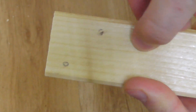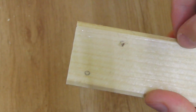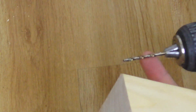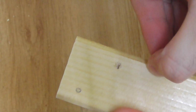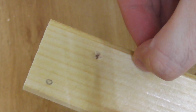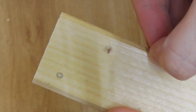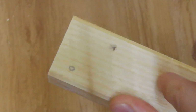So we have these lines of the wood. Those lines are harder and between two lines is softer. So your drill bit should not go exactly onto a line, because from there it will automatically jump either to the right or to the left. Better put it a little bit to the side and then come back after the hole is a little bit deeper.